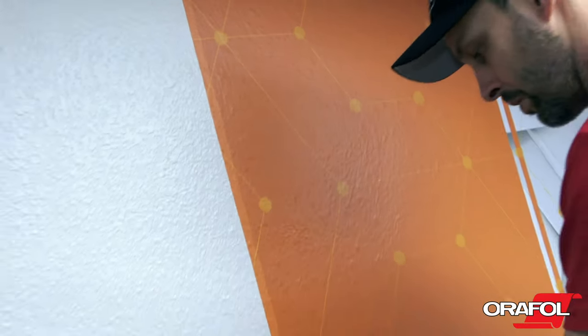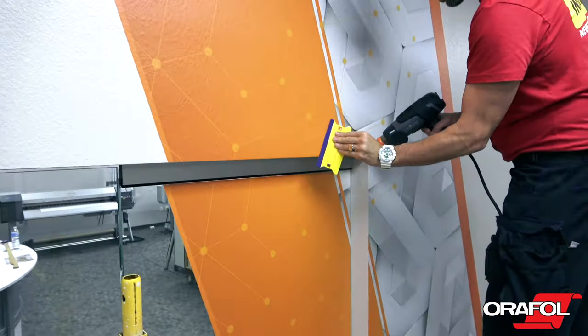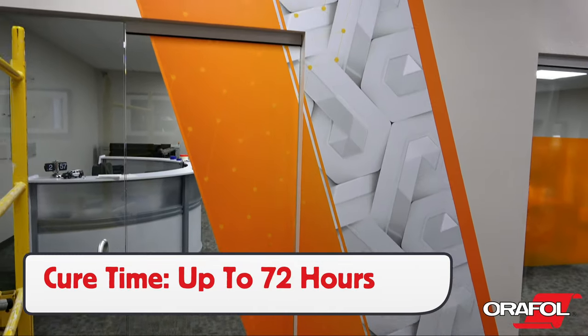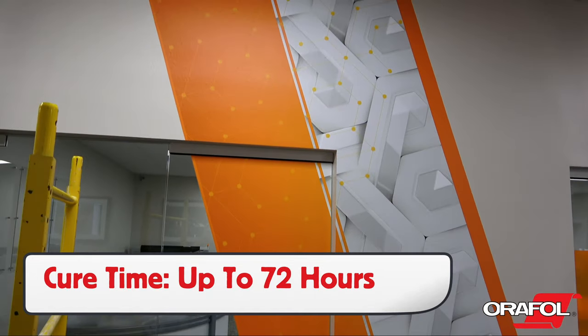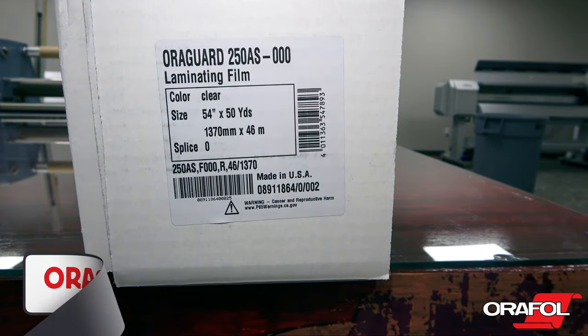Installers can apply light heat on edges if needed. Be sure to keep the temperature of the heat gun between 100 and 150 degrees Fahrenheit. Cure time to reach maximum adhesion is up to 72 hours.